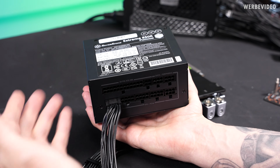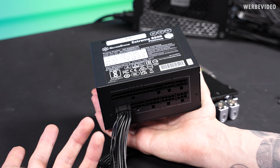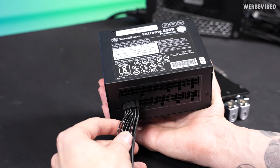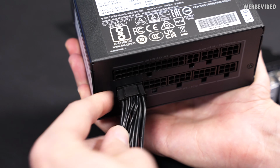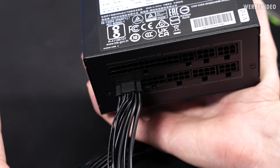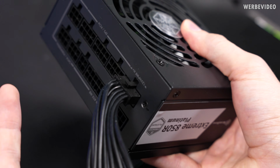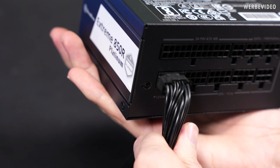You could theoretically do the same mistake on the PSU side because it's a native 12-volt high-power connector, but also here it's fully plugged. I cannot see any small gap on left and right. Looks fully plugged to me, no user error for sure. And also again, on the cable itself, it looks all absolutely normal to me.